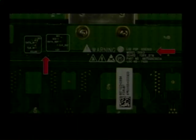Self-documentation: those dumb Chinese power supply boards that are in every LCD TV usually have all of the input and output and expected voltages on all those connectors cleanly labeled. Makes it really nice to troubleshoot. If you look at this one, they have some test points that were left there by the factory. And this one says something like data in, clock, data out.